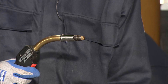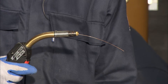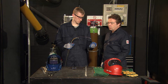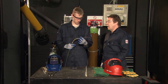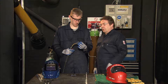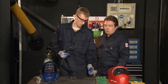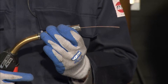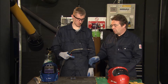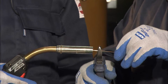We'll wait until the wire exits and we want about 3 inches — for safety purposes make sure you keep your hand away from the end of the torch. We've selected the appropriate contact tip: 1mm with an M8 thread, or you can use 1mm with an M6 thread depending on the torch head you've got. For this purpose it's a 1mm diameter with an M8 thread. Next we fit the gas shroud, make sure it's tightly seated, keep your finger away from the torch trigger, and cut the end of the wire — give it a little pull to take up any slack and trim it back about 10mm.